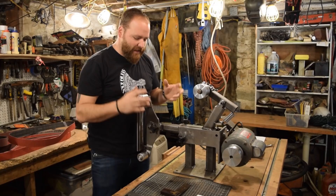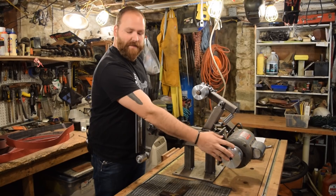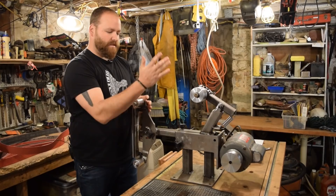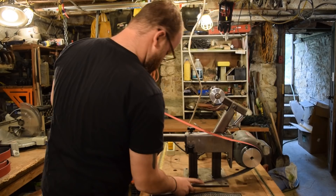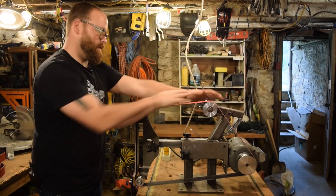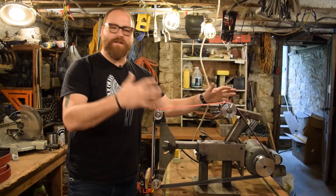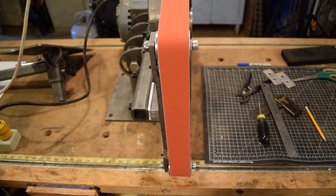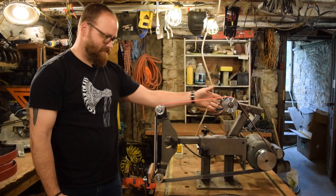All right guys, it's the next day. I came back down last night and kept messing with this because it was playing on my mind. We put the spacer in here on the platen arm to bring the platen out, but I was thinking the wheel wasn't aligned correctly. So I added a few spacers in the back and got it more perpendicular to the actual tooling arms, which aligned the wheel better. I was able to put a belt on and get it running true. Let's go ahead and throw a belt on now and show you how she works. Yeah — that tweaking really made a big difference. The tracking is really nice, running straight down the platen. That's great — oh man, I'm super excited!